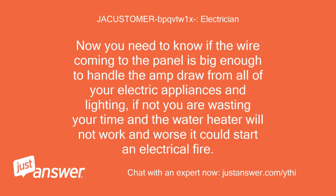Now you need to know if the wire coming to the panel is big enough to handle the amp draw from all of your electric appliances and lighting. If not, you are wasting your time and the water heater will not work, and worse, it could start an electrical fire.